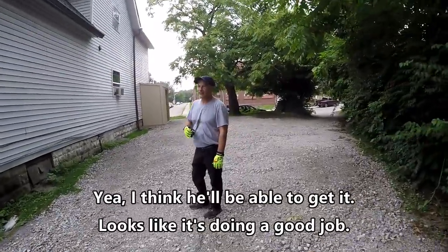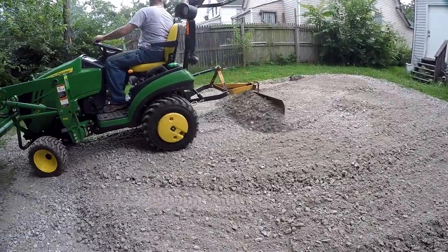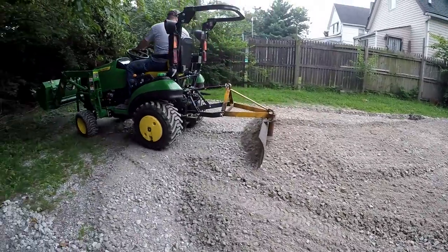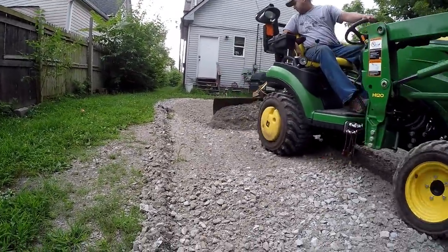What do you think so far — easier than a bucket and a shovel? I noticed you did several different techniques; can you talk about those? Well, the objective was to take this hump down in the middle — it wasn't too exaggerated by the time we got there, but there was some. So the primary thing I did was use the rear blade and try to just kind of shave it off.